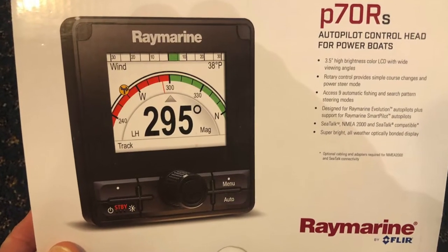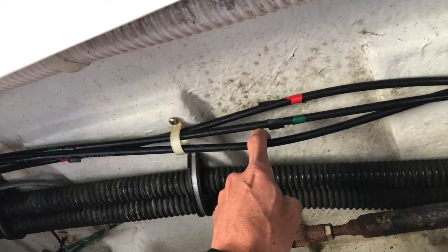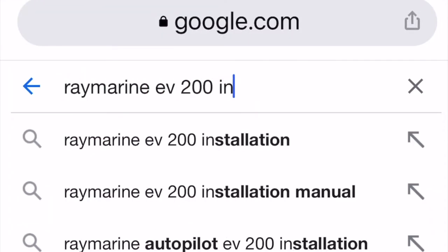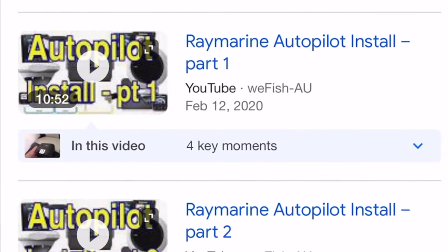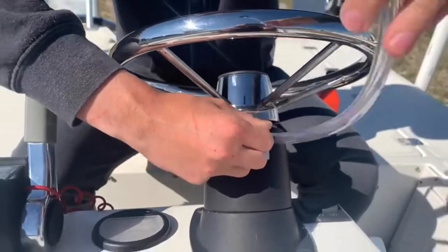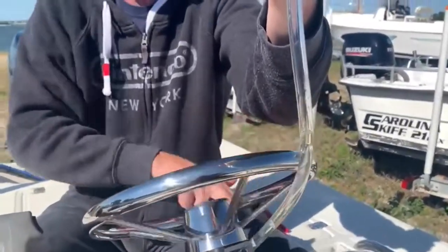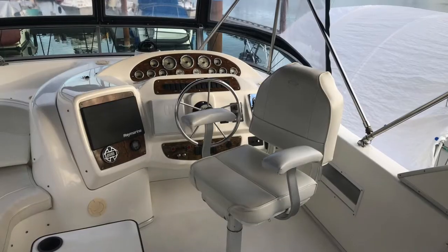I was pretty excited to learn how to do the installation myself, but I was totally intimidated by the thought of cutting into my hydraulic steering lines, and I was even more unsure of how to bleed the air out of the lines after the install. I counted on YouTube, but unfortunately all the videos I could find — although really good — covered how to bleed a system where there was a reservoir built into the steering helm, often involving hooking up tubes to the hydraulic piston and pouring fluid in at the helm, then turning the wheel to get the air to rise to the highest point.